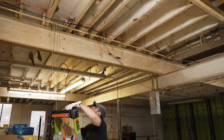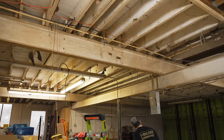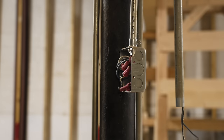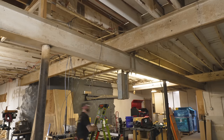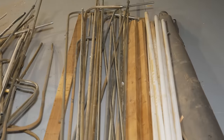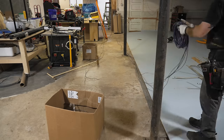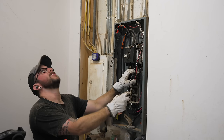Now that I was removing the fluorescent lights, I could finally get rid of the extension cord running to the open junction box that the previous owner had left powering the lights. I started removing disconnect boxes and junction boxes, double-checking everything with a voltage tester since another sub-panel powers a few of these circuits. I'll be saving these boxes to potentially reuse when I rewire the shop. Once the boxes were removed, I started taking the conduit apart — saving pieces to reuse later and throwing out pieces with lots of bends, though I probably salvaged a few hundred dollars' worth of conduit. Once each circuit's conduit was disassembled, I traced the wires back to the panel to disconnect them.